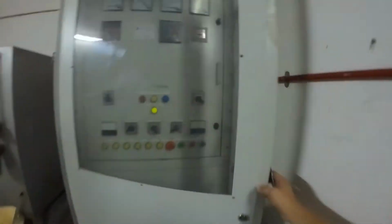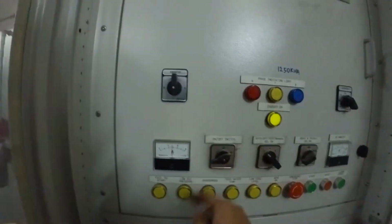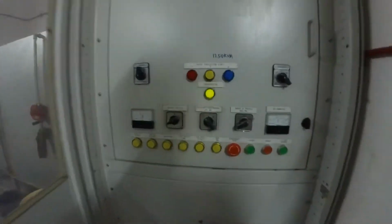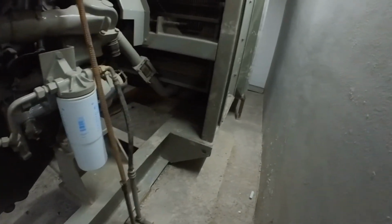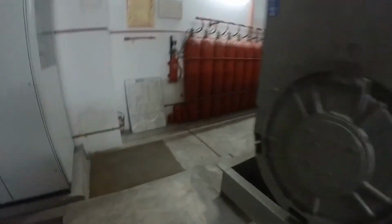Okay, after the genset stop automatically by itself, do make sure emergency stop release back to auto. Charging of the battery is okay. Voltage okay. ACB don't trip. Everything is in auto condition. Okay, do check the fuel level, drop how much, and physically check the genset. There's no oil leakage, petrol leakage, radiator water leakage, no leakage, make sure. Battery termination tighten.